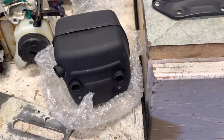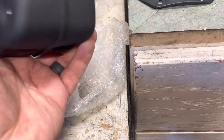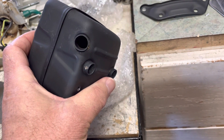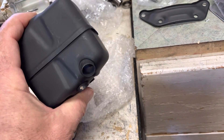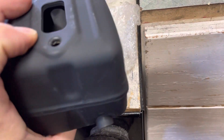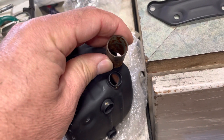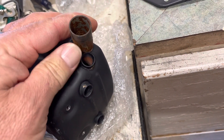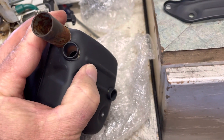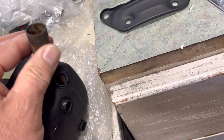Another thing I was going to do — making these pipe mufflers for the 372s and the 385s and the Husqvarna 390s. This is Husqvarna stuff obviously. This was on eBay — Farm Mac, was it? Farmer Mac? The other saw company. Anyways, this kit is actually kind of rather neat. It's just basically your standard can — nothing special, like all the aftermarket cans in here, very choked off. Taking a little pipe like what I have here — I've salvaged this little piece. I'll keep the hole, put it up right above in there, and it'll roughly look kind of like that, and that will make this stock-ish muffler breathe a little bit better.